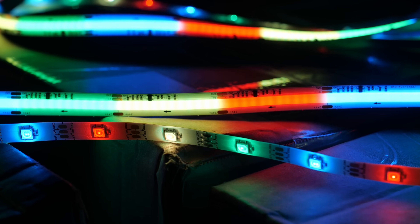We're again going to look at a COB LED strip, but this time it's 24 volt addressable — not individually per LED addressable, which is basically technically impossible. But in my opinion, even with some compromises, this strip looks absolutely amazing and is the strip to recommend for any wrap-around-your-room or similar style project. This new strip has a staggering 720 LEDs a meter. When you think about how they're able to cram 720 diodes into that small amount of space, it's truly amazing. Now that number is a technical number — basically there are 240 red, 240 green, and 240 blue diodes in the space of a single meter. Calculating that way, a traditional 60 LEDs-a-meter strip would have 180 LEDs. Still, it's a massive increase. These diodes are arranged in 5 centimeter (about 2 inch) wide sections, and each section contains 12 of each color spread out over that section.